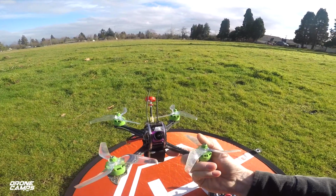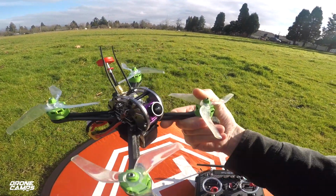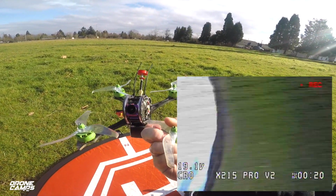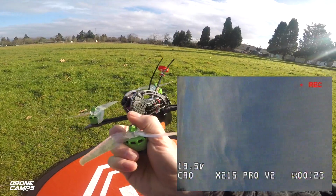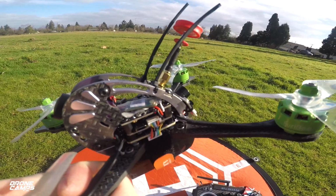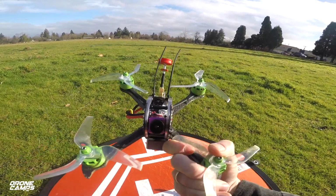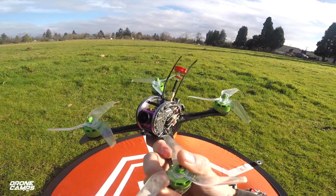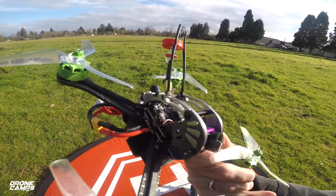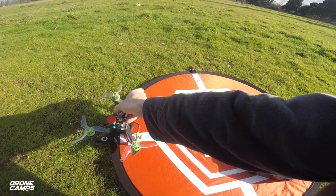It was causing the quad to violently vibrate when I did a hard turn or any type of quick turn. So it would just kind of do this sort of overreaction real quick, mainly because the gyro is moving because of the light foam that they used. I also secured the receiver on there with another piece of VHB because it also came off in my previous flight test. So I did a line of sight test with it just a second ago, and it's doing a lot better now that I sort of soft hard mounted the gyro on there with some VHB. It's just a little more tacky than a piece of foam would be.